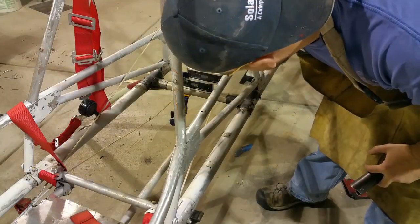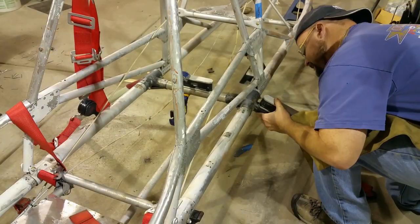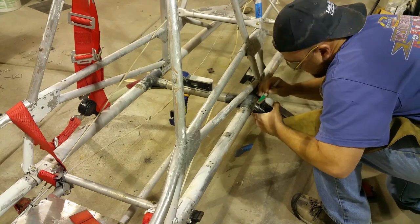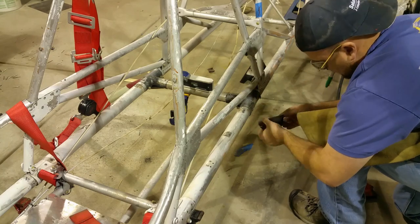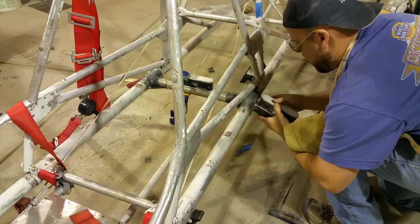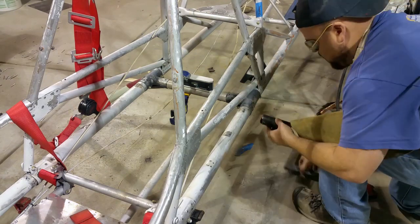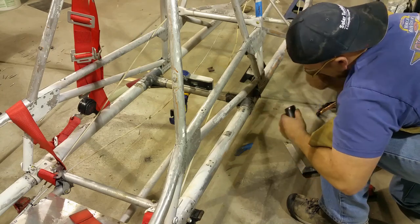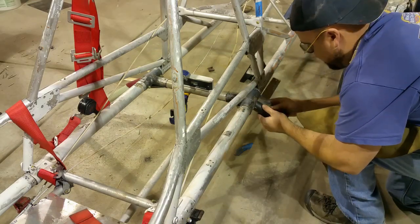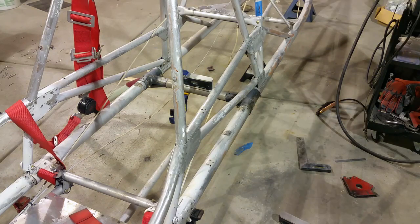With everything being prepped, I moved my attention to actually welding in the replacement tube, using the inclinometer and measuring off the other side. I aligned the tube since I didn't have particular dimensions to go off of, but the other side appeared undamaged, so I used that as a starting point. I always leave an inclinometer stuck on the fuselage and zero that way, in case you bump anything, that you still have a good reference. So that's actually clamped on there very rigidly.